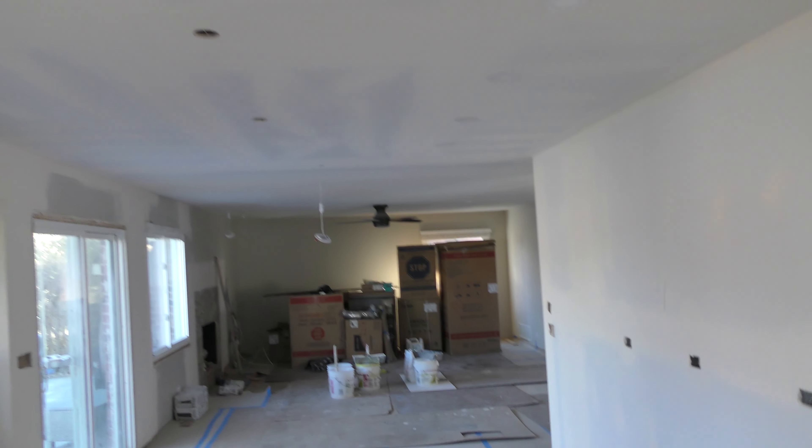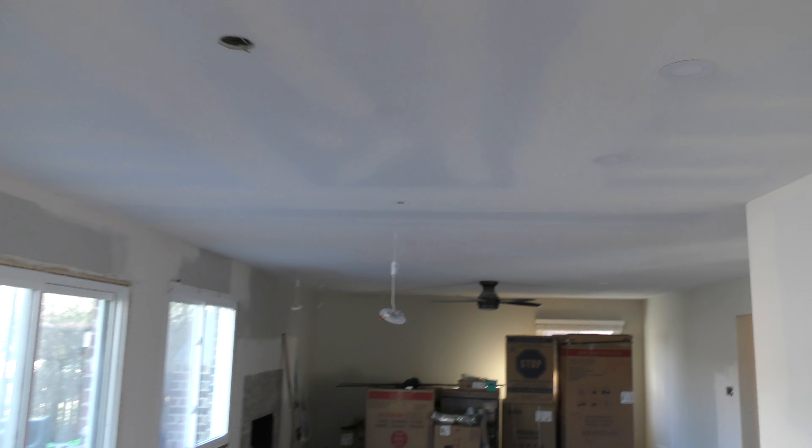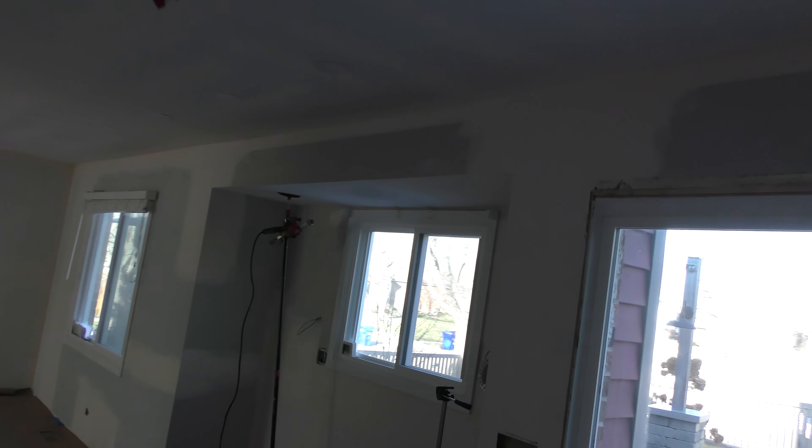I want to show you what I've done in here. I've done this whole ceiling. I put a control joint here across here because that's a long way from that wall — it would crack somewhere in the ceiling otherwise. I'm doing this patch right here with my heat gun on that pole, like I showed you.